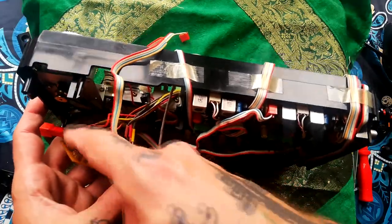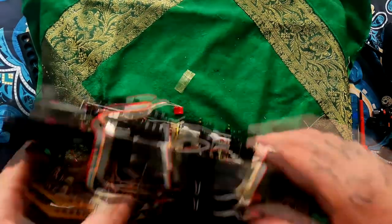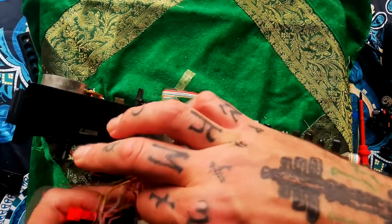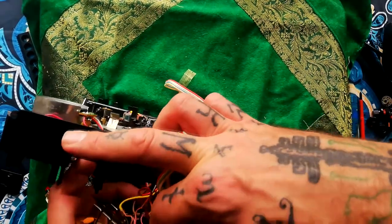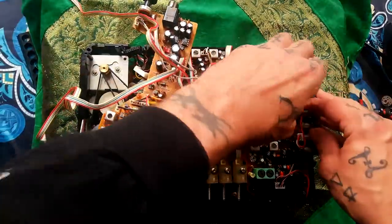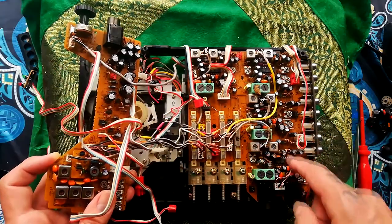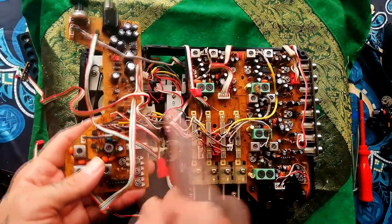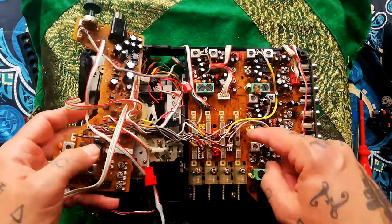You can see there are large black and white KK Molex header connectors here — those will be going to your tape heads. Those wires are delicate; you could use a flat head screwdriver or needle nose pliers to get them out. I'm just seeing if they come out with my thumbnails — and it works. This one here will be a record/playback board, transmitting information between the magnetic heads. The magnetic head information comes in via these two sockets and exits via these cables.